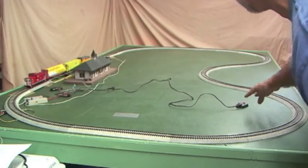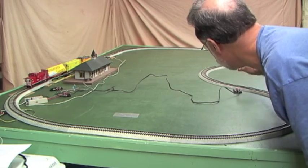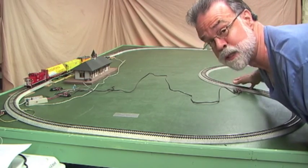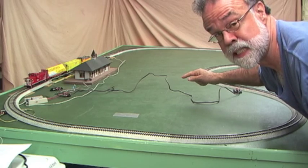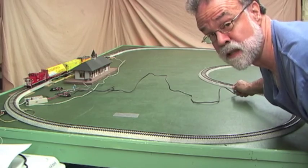Now let's talk about two-train operation, which is what we'll try to do next. With no change in configuration or programming to this system, the train is sitting there waiting for that button to be pushed before it will move. If you replace this button with a second reed switch connected to the acceleration terminals, instead of pushing the button to release the train, a second train coming along with a magnet can cross over that reed switch and release the train. So we'll do two-train operation with no change to the system other than replacing this button with a second reed switch.